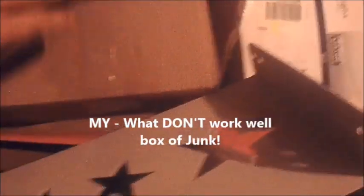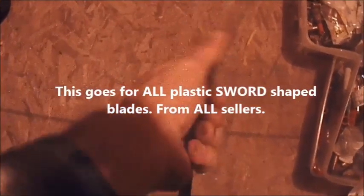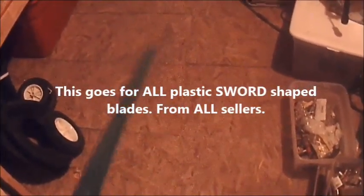What I mean by cavitating is the blade tip is doing this — it's vibrating back and forth. While your blade is fluttering like that, it causes that vibration to travel back to the hub, and it's jerking on that bearing constantly. I took a bearing out from a Missouri turbine a while back and tried to figure out why it went to hell — it's the same reason this one is going to hell right now. My results are pretty simple, pretty categorical: turbine blades that are plastic — they vibrate, they wobble, and they just can't be made right.